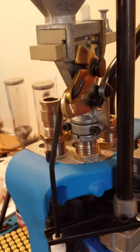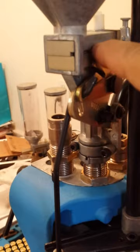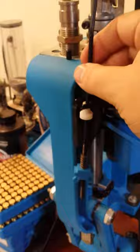Let me show you how this works. We'll say we have a primed case in here. We're going to pull back on the handle and watch the primed case go up — it's going to hit the powder funnel and you're going to watch the linkage go up. It pushes the charge that's in the bar to drop into the funnel and into the case. Now you can see this linkage bar just hangs there — it does nothing on the upstroke.